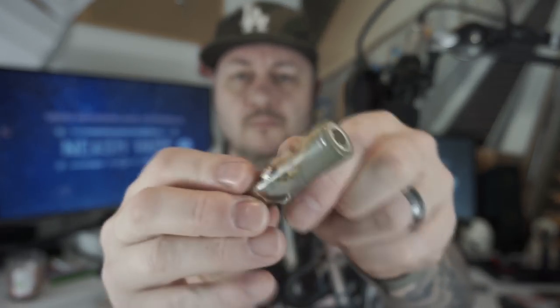So it's basically get a nail or something, well, fingernail or something, and just take the old battery wrap off. Make sure your battery underneath is decent quality. On top, on the bottom, well, this one's a bit dirty, but make sure you've got no rusting or pitting or anything like that. If there's any dents in it or anything like that, get rid. Just don't risk having a dodgy battery.